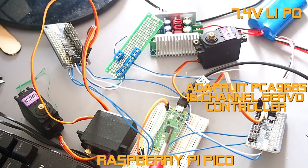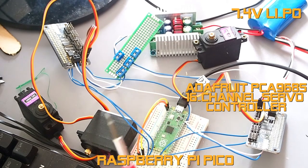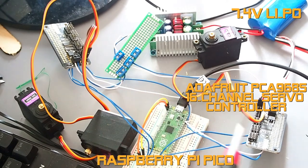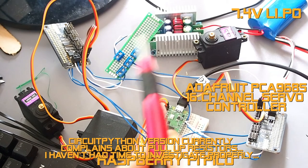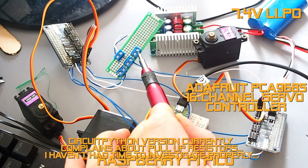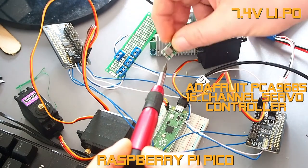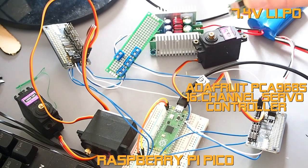After a lot of playing about with the old deprecated Adafruit drivers, it's not too difficult to daisy chain these boards together. I have one board that takes the nine servos on the left-hand side and one board that takes the nine servos on the right-hand side, and I've proven I can drive both together or independently. On the actual robot, I'll step down the current again — taking nearly six volts from the buck converter and stepping it down using a much smaller step-down converter to just below five volts for the Pico and also for the Raspberry Pi Zero.